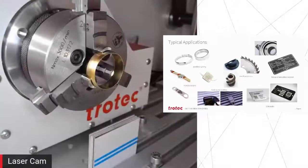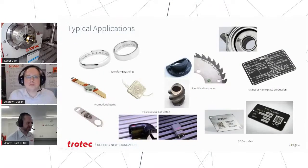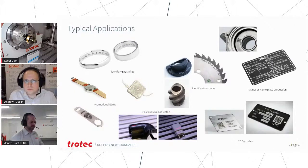Fiber lasers are a really wonderful metal marking technology because fiber lasers have a much longer pulse than older similar technologies like YAG lasers, vanadate lasers, that kind of thing. They might be 10 times longer for each shot of the laser. So consequently, you're doing 10 times more work on the material and getting deeper engraving much more quickly. They're also far more efficient in terms of power usage and don't require any real servicing, as goes the laser source itself, over the lifetime of them. So they're really lovely bits of kit.